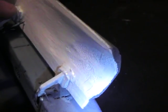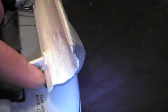The spring loads for these are real easy to make. You just buy you some little bitty 1/64 music wire, coil it around a little jeweler screwdriver once or twice, leave two open ends, one end up against this and the other end up against this side right here, and you got an instant spring loaded hinge.